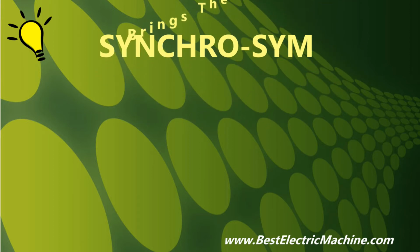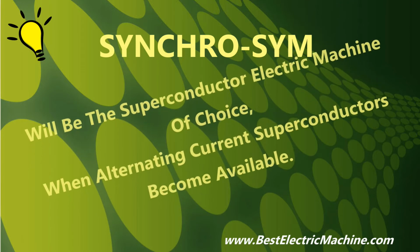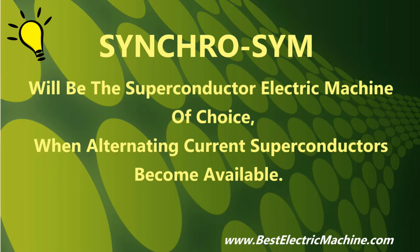Much more beneficial than just the substantially higher flux density provided by passive DC superconductor electromagnets, superconductor alternating current, or AC, multiphase winding sets, which also provide significantly lower overall electrical loss, are being aggressively researched, and when practical, a brushless, fully electromagnetic AC machine, as only provided by SYNCHRO-SYM, would be the obvious choice for the AC superconductor electric machine application, particularly after realizing that today, the induction electric motor, with a passive rotor, is industry's best consideration for implementing the fully electromagnetic AC superconductor electric motor.